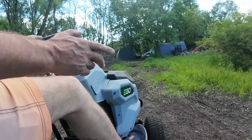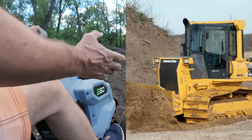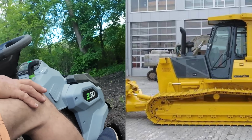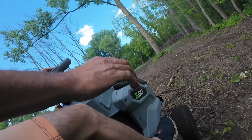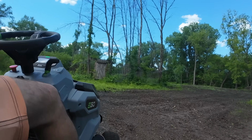What I was saying was that Komatsu D41P was a one-track wonder. It had a single control, so when you wanted to turn, only one track had power to it in a turn. And what I wanted was a dozer that had power to both tracks, so you could do a power turn, hold on to more material, and be more productive.